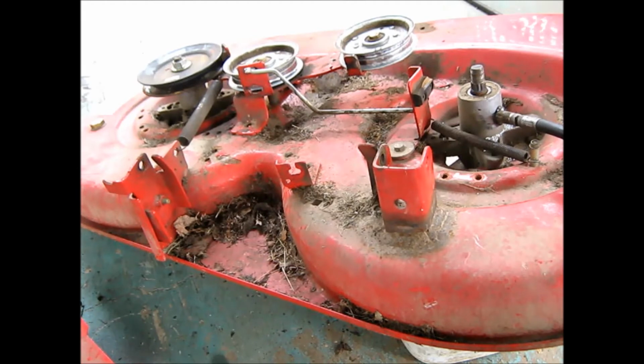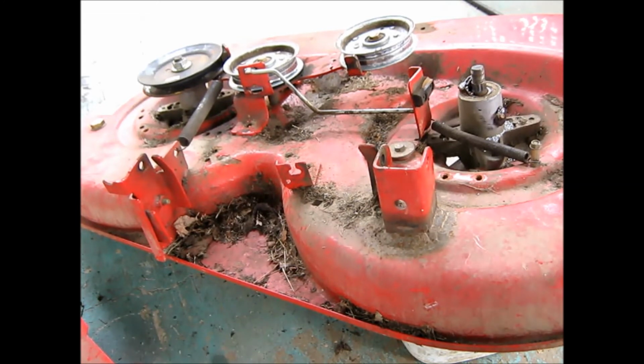And it should be getting up there about four tools long. There we go. You see? There we go. See? Now we got grease up there. So it pushed it on through there, and it's pushing through the seal, not through the spindle. So now we're going to go ahead and put the pulley back on, because if we don't, that thing's going to drop down through there.